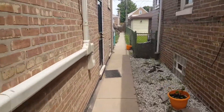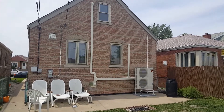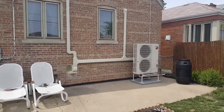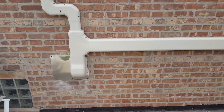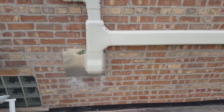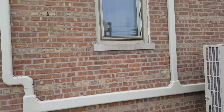Walk into the back. Here we are in the back of the house. We got our 48,000 hyper-heating outdoor unit here. Up top by the top window goes to the back bedroom, and then the other one to the right goes to the bedroom on the first floor. And then everything kind of comes back over here behind this hole — there used to be a foam-filled hole there, which made it nice for access. That's where we go into the branch box from the outdoor unit, and then we're coming back out to run these two lines on the back.